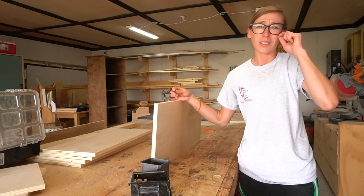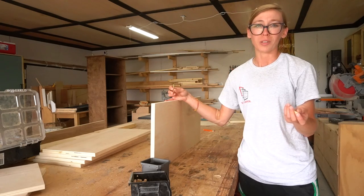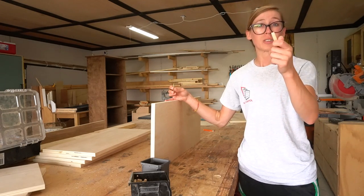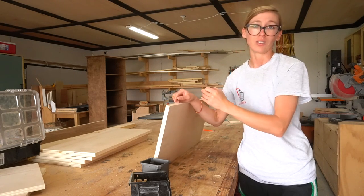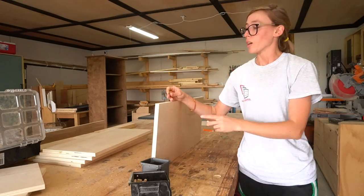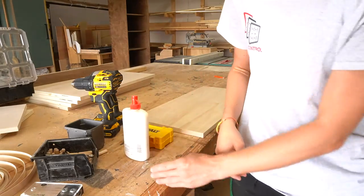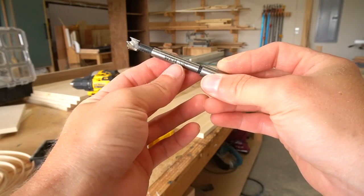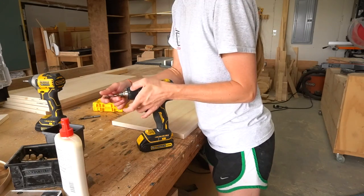Of course I could use dados for this, but I'm not going to do that. I was going to just use wood dowels for joining, but these weren't long enough and I didn't have time to get others — so we're just going to use these as plugs and use screws for joining. I grabbed some drill bits to pre-drill the screw holes, some wood glue, and a 3/8 inch Forstner bit to countersink holes for the 3/8 inch dowel plugs.